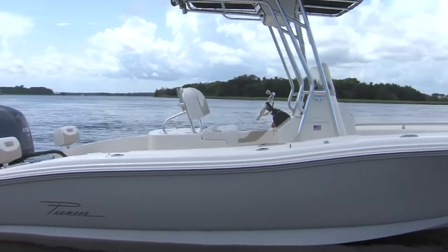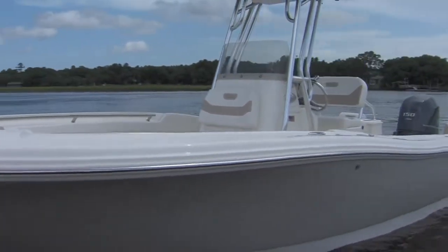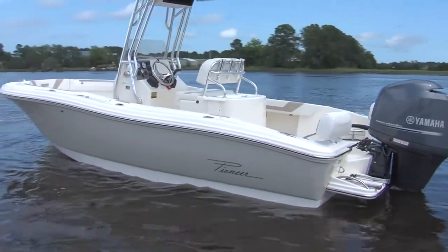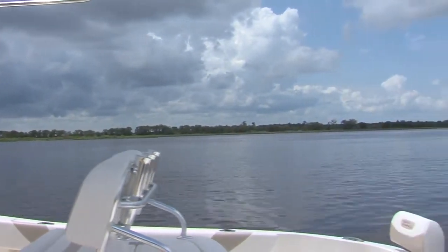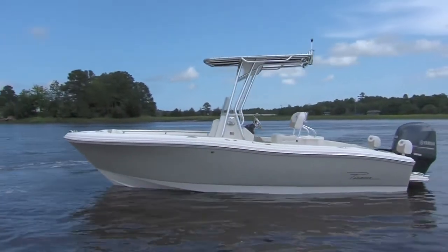A few of the options available for this boat include our T-top, and we do T-tops a little differently from everyone else in the industry. Most people bring the T-top legs all the way down to the floor. The problem with a small boat is you're always fighting for extra space — if you have the console sidewall and then a leg coming down to the floor, the usable width in the boat has been decreased by three to four inches on each side, which is six to eight inches total in a small boat. What we do is bring our T-top legs down and attach them to the side of the console. Most people in the industry won't do that because they have an inferior way of attaching their console to the hull. The way we attach our console to our hull, we don't have to worry about the console breaking loose.